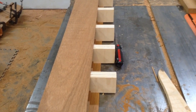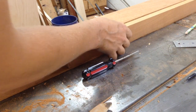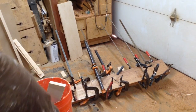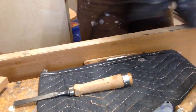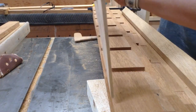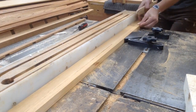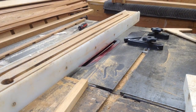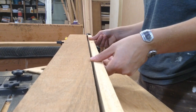I went back to the spacer — I added my edges in the back and left my plywood pieces long. This spacer you'll never see, which is why I used a butt joint in the back. I changed my mind about how I was going to attach this — I decided to use a French cleat instead of mortise and tenons, so all those extended plywood pieces I had to trim down. I'd rather over-cut things and trim than mess up the first go-around. At this point the front decorative section came out of the clamps with a lot of glue on it, but sanding removes all of that quickly. I added a very thin rabbet to the back side of that spacer and then cut my French cleat — just a piece of mahogany; this is all built out of mahogany. I'll have one receiving end on the spacer, the other end on the back of that decorative front, and then this will just fit into place.